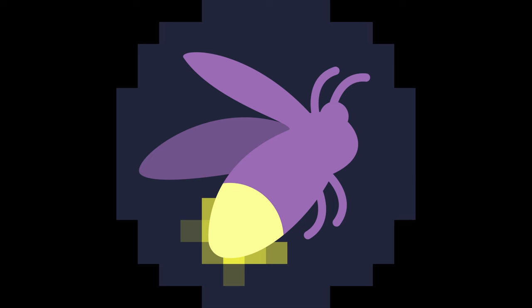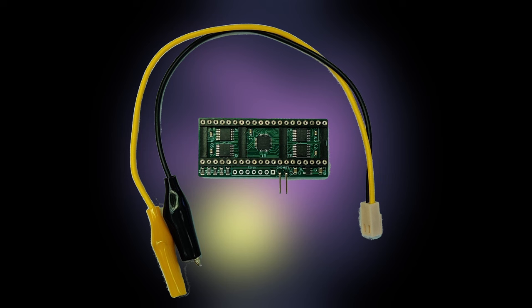The upscaler — in this case an RGB to HDMI equipped with the analog daughter board — receives this analog signal and then, using a comparator on the analog board, converts the voltage levels back to binary digital information that it then uses to reproduce the video and output it to HDMI. This can be done for a myriad of video chips, and Copper Dragon has designed his interposer boards for many already. You've just seen the GTIA digitizer at work.